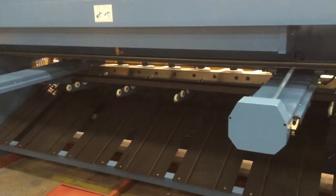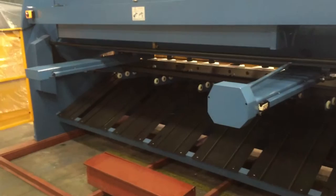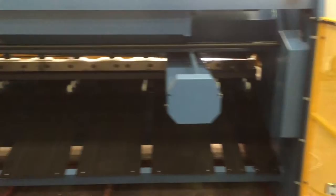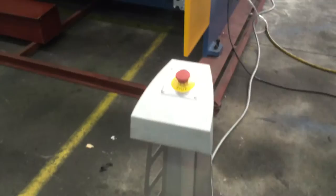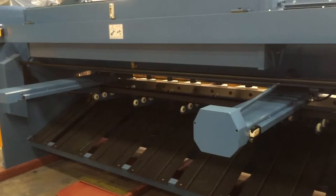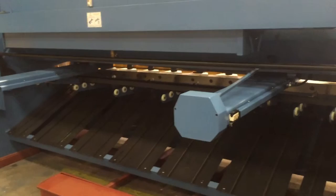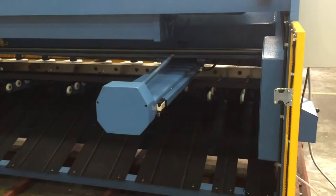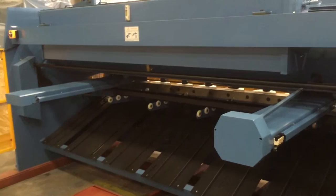I'm going to go back to the front and reset the safety. The rear sheet support systems hold your material level, so when you're feeding it through, this back gauge goes to 950mm and then swings out of the way. The back of the machine is also guarded — so there's plenty of guarding and safety; if anybody comes behind the machine, it turns itself off. I've brought the pendant around the back so we can see the machine operate through the sheet support systems. Currently the sheet supports are in the up position, holding your material level to your back gauge so you can feed. I'll stroke it now — the guillotine's cutting, it backs up again, and the sheet supports go back up to their start position. See how easy that is? Fantastic device — you can actually turn that off and on, you don't have to always have those sheet supports up, but it is very handy.